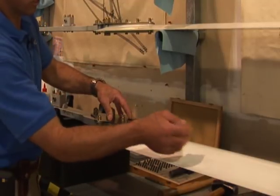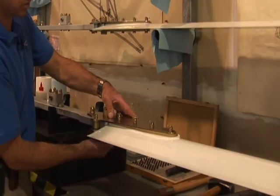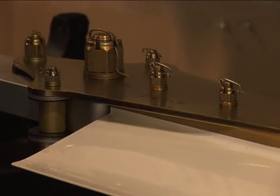You'll run the blade in between the two retention straps. Push the bolts from the bottom to the top. You can use a drift pin to help align — do not pound them through. You want to rotate them; you don't want to wreck the threads.